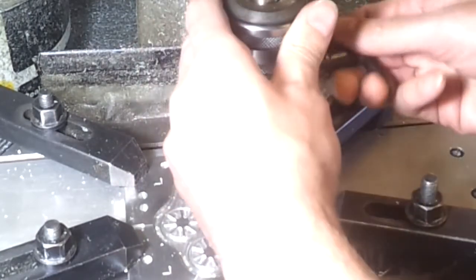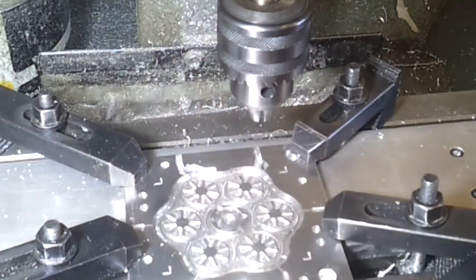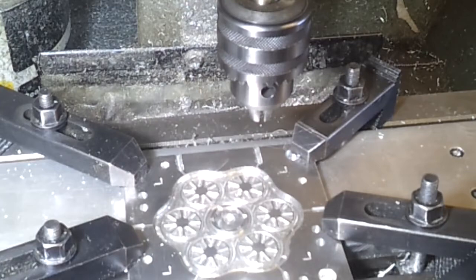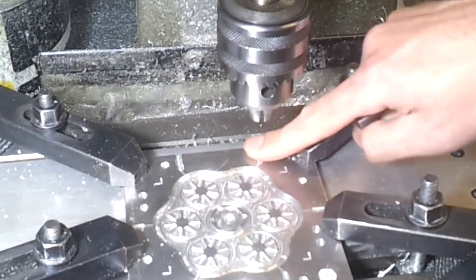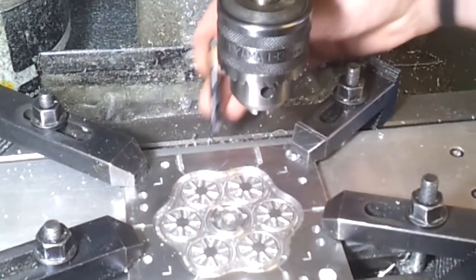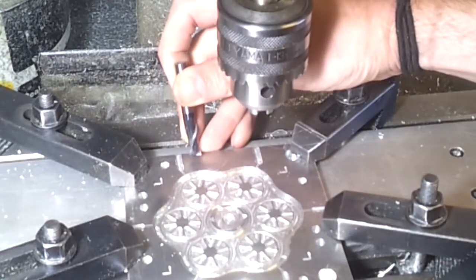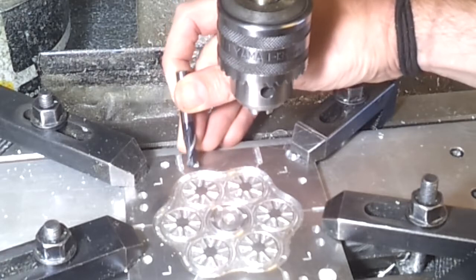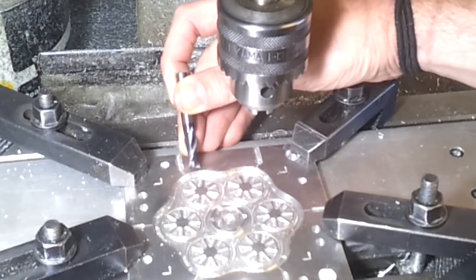Almost it. I just want one more feature. There are the small vents on this side, and I've already done the ones down the bottom here. And what I now want to do with a fairly chunky slot drill is just come in above the plate and ramp my way down to just connect with this edge, maybe about 1/4 of a millimeter down,